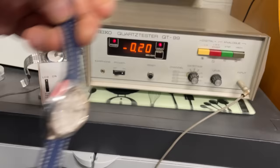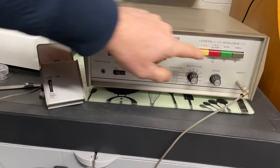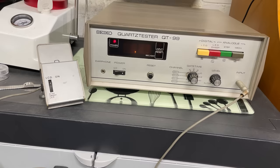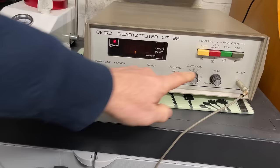So I'm going to test it — I'll show you what I do. First of all we'll take off the digital watch. I then have to click this little button down here and turn it to 'step,' because it has what's called a stepping rotor — a little magnetic rotor that's all to do with the coil and everything else. I'll go into that in a better video later on. Then we put that on there and now we see it pulse. We've got this set to 10 seconds so it'll do 10 seconds before it gives us a reading. And there we go — it's come up already. This one's almost the polar opposite of the other one — we're running at around 0.27 to 0.38 seconds a day, so roughly plus 7 seconds a month.